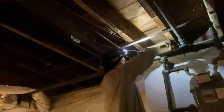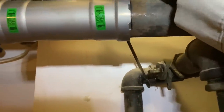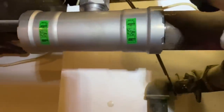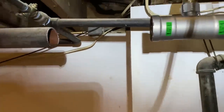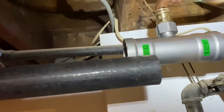Now I'm going to take some emery cloth and clean the remnants all the way around — get it as nice and smooth as possible, removing any remaining paint as well. I got my fittings all the way in, took my Sharpie and made a mark. I'm going to check my insertion depth and then make that up right there with the coupling and a piece of two-inch pipe. My Viega two-inch slip coupling and the piece of two-inch line up right there and I'm going to cut it.